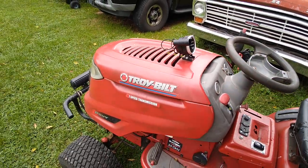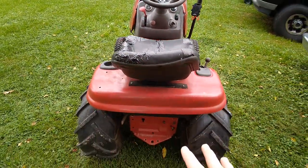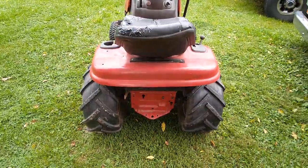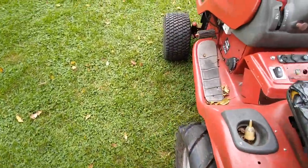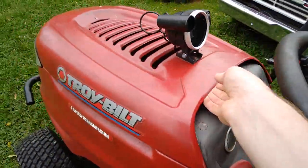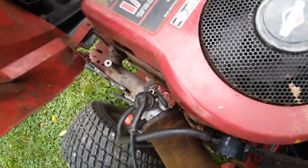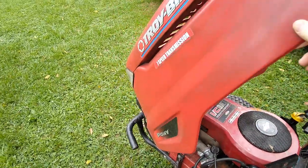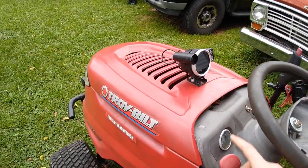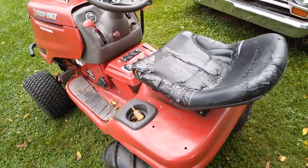I need to find a switch and mount some rear lights — I have tail lights and a backup light combination going on, I just need the switch to complete it since the one that came with it was no good. I also need to find a way to link my choke to the carburetor; currently there's no choke going into the port and I have to figure out how to put a bead on the end of the choke cable — probably just put some solder on it. I also want to take the factory hand throttle and turn it into cruise control for my foot gas pedal.